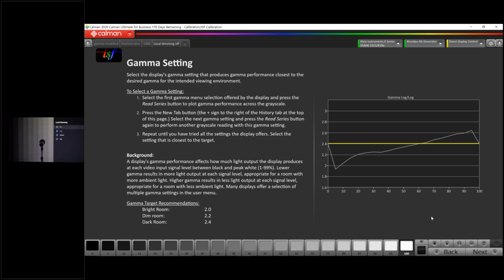With the local dimming off, the grayscale, oh yeah, you can. The grayscale is a little bluer. With the local dimming on low, it looks a little closer to correct. And the blacks are better. Let's try medium. And by the way, the reason I pointed that out, guys, about off looking a little blue, that's not normal. Most TVs, if you turn the local dimming off or on, or turn the backlight up or down, everything should move in a uniform fashion.